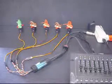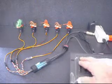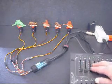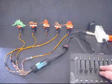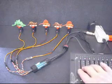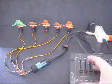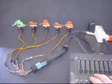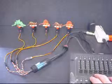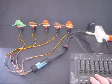DMX 512 base address: channel 1 is controlling our first servo, 2 controlling our second, 3, 4, and 5. All DMX devices have what's known as a base address — this is the address at which the first channel in the fixture starts. In this case, the fixture is the Servo Pack 5, and the base address is somewhere between 1 and 512. A DMX 512 fixture requires a given number of channels. If it's a simple monochromatic light fixture, it may only require one channel; if it's an advanced LED fixture, it may require seven.